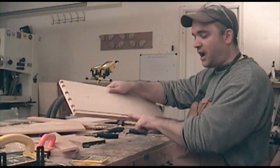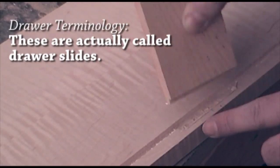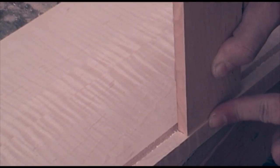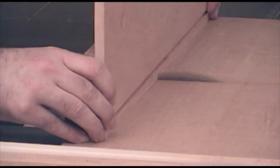With the chisel, I made a notch in the back of each drawer front to receive a drawer runner. The runner was half-lapped and it just sits right in this notch that I created, and this will be glued in. At the table saw sled, I'm going to nibble away a little section in the back of each drawer to receive the drawer runner.